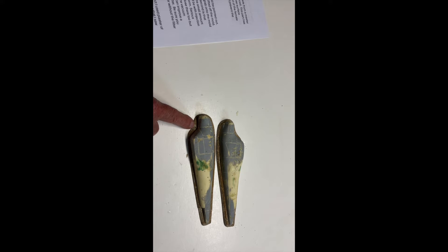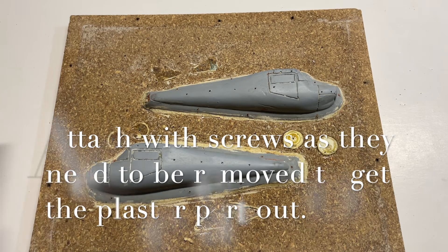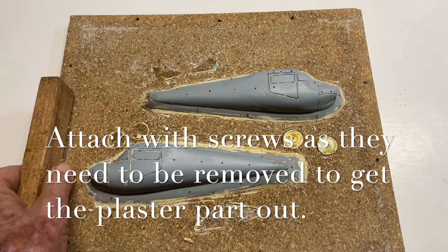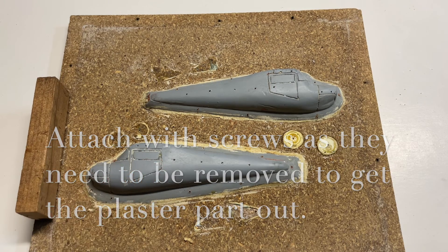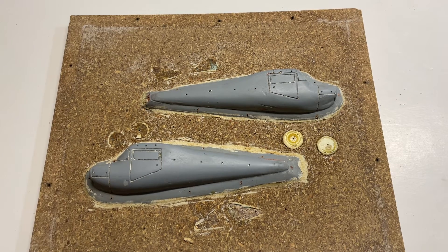This area here is one I added to improve the flow into the mold, though I don't think it's really necessary. Once you have the master mounted on the flat board, you have to put a surround on the flat board that's taller than the top of the pattern — otherwise you won't be able to fill it high enough to cover the part. It goes all the way around and contains your plaster when you pour it in. The part also has to have lots of holes, into which you insert wires to provide the entry or exit points for the vacuform air. Your ready-to-pour mold would have wires sticking out of every one of those little holes.